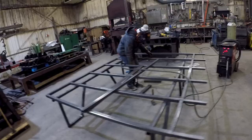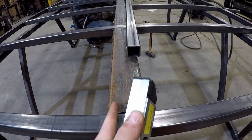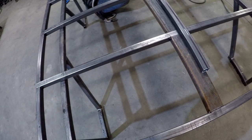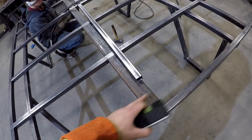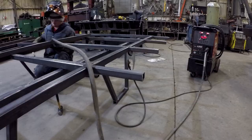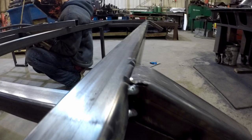We're putting some three by one-and-a-half inch tube in the center so that when we put the plywood deck on top we can screw into both sides of the seam. Over here we got all six of our extensions in — some are a little tight but should loosen up. We got our angled pieces tacked in and had to modify one corner a little to keep it flush on top. Then we got the bar for the step to hold the ramp on.